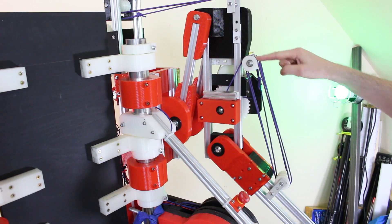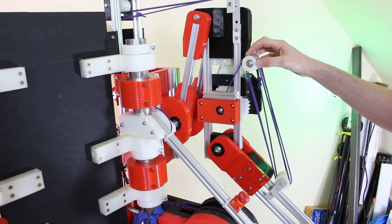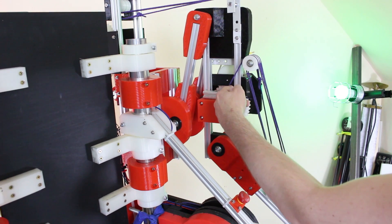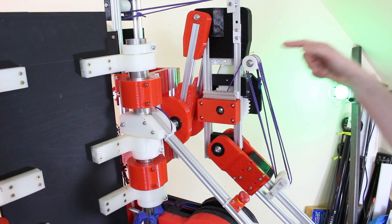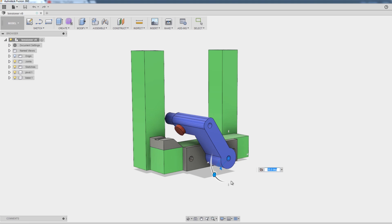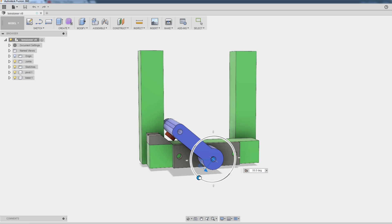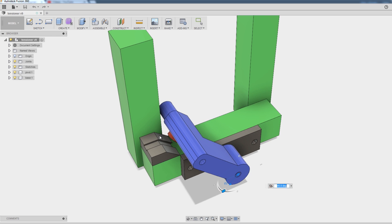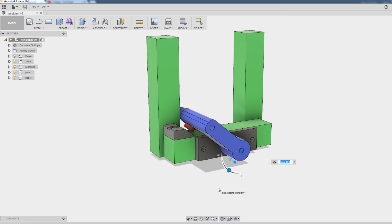At the end of this video I should be able to walk around moving my arms and legs. My arm mechanism consists of a block and tackle with a pulley that spreads the load over multiple 3D printed pulleys. We need to detect when the string goes slack so it doesn't pull off the pulleys when I bend my arm. I've designed a little mechanism that sits between the two uprights, sprung in one direction with the string pulling it back the other way. There's a magnet and a hall effect sensor mount so I can measure the distance and run the motor to take up the slack.